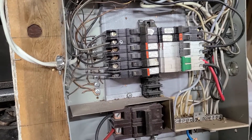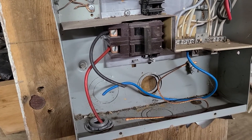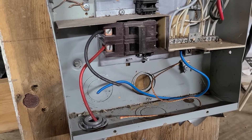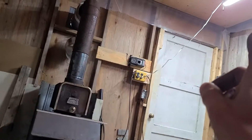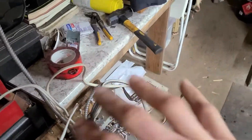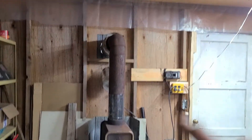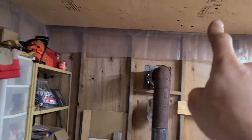I got to pull all this crap out of here. I just took the face plate off to show you guys and clean it up a little bit. I'm going to stick this up in the crawl space up top there, because that's going to be where I store everything. I'm about to go up there and start laying some electrical — I'm going to put some 110 plugs in the ceiling for the lights and run them to a switch. But if I put this up in the crawl space, anytime I want to run a wire or add a circuit later, I can just bring it down, drill a hole, and it'll be really easy to add plugs later.